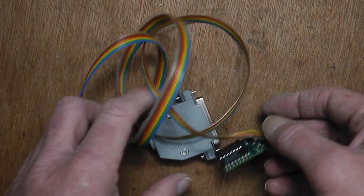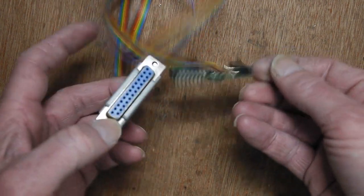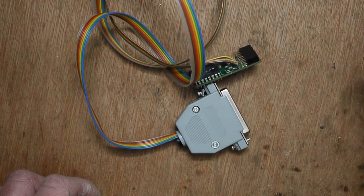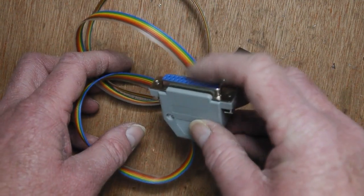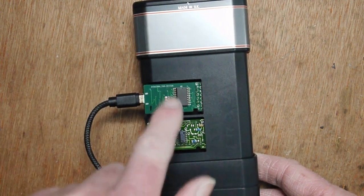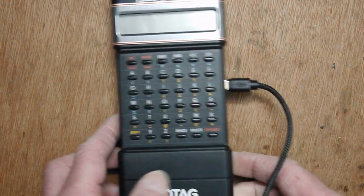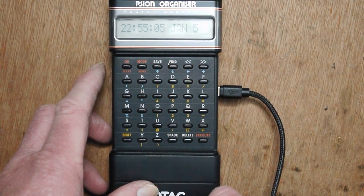This is my replica link-up pack for the Organizer 1, and it gives the Organizer 1 a serial RS-232 port. I like the idea of this because I can send data to and from my PC from the Organizer 1. Not a lot of my computers have a serial port, so when I was laying out the replica RS-232 link-up board, I created one which has the RS-232 chips replaced by a USB-to-serial chip, and that gives you a USB link-up board for the Organizer 1.